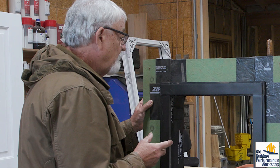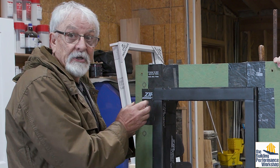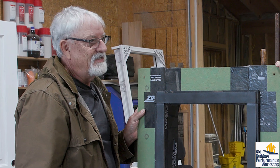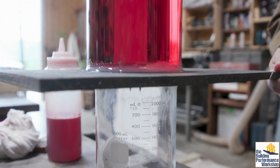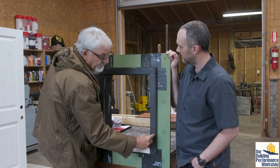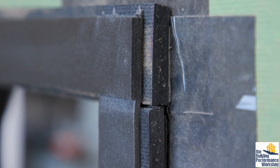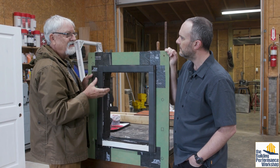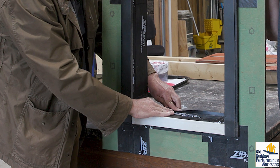Now that you've got their tape doing that, there are other things you can do to a window opening. One thing I've seen in the field is the question of how to pad the window out or buck it out — so if you're putting in a drainage plane or you've got brick, you want to pull the window out. As we saw the nail-sealability on that material, you look at that attribute and say, 'Wow, that's fantastic.' So I ripped some down to two inches and put it around the window. When I set the window, all the nails that go through that material are going to be sealed. It also has screw and nail holding the same as OSB, so you're not going to lose anything as far as the structure of the window.